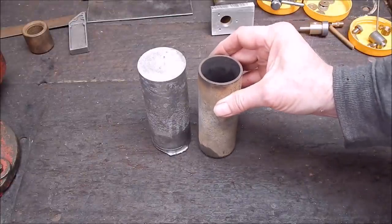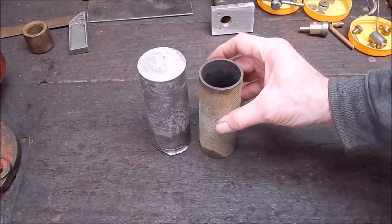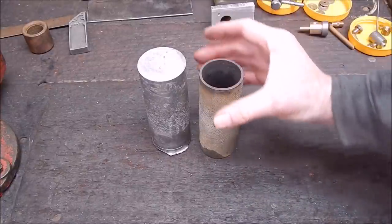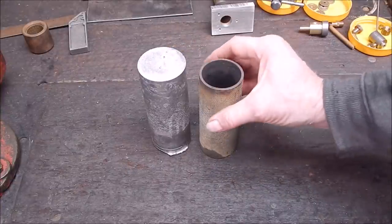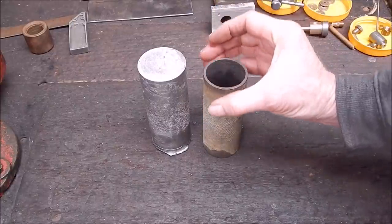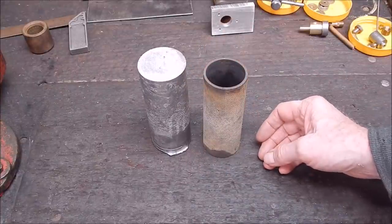You preheat it when you're melting the aluminium in the furnace, or whatever you've got, get this nice and hot at the same time, okay? And then when you pour the aluminium in, it will cool down slowly. You don't want shock cooling. I used to drop it in the bucket of water, but that's really a bad thing. Let it cool down slowly and have the mould as hot as you can get it. Then everything will just cool down slowly. You won't get the aluminium not flowing properly, getting chilled when it shouldn't be.